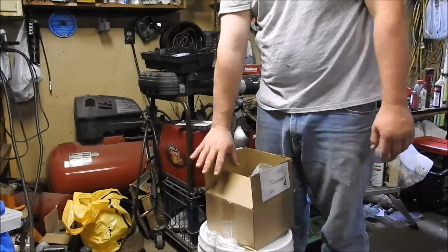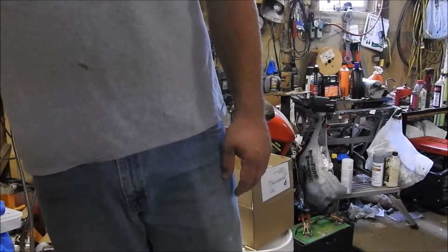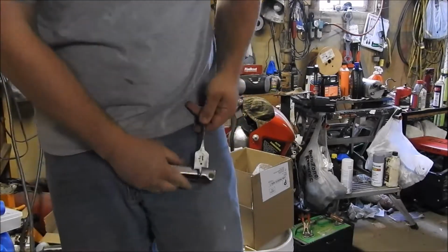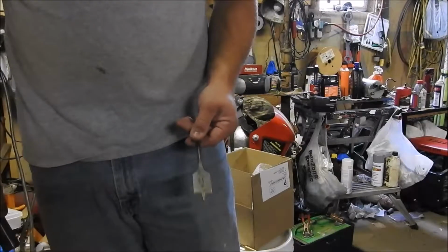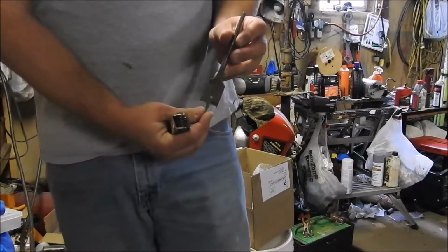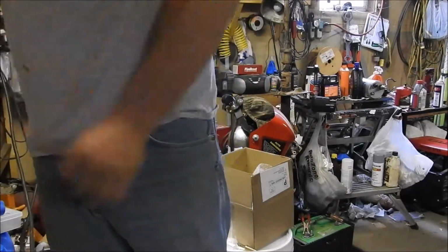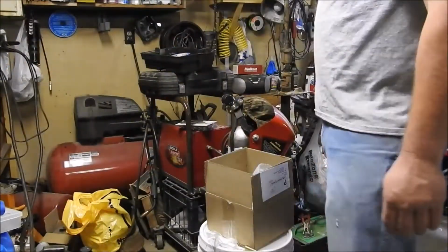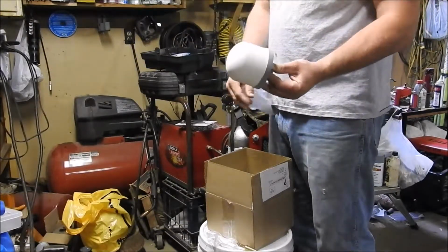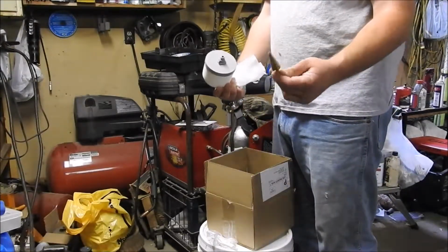So I've seen people try to drill these buckets using paddle bits, and for those who don't know, that is this right here. These things in plastic will actually make a triangle hole because there's nothing to guide the tip to keep it from going off center. So if you're trying to do precise holes like I'm going to be, then you want to use a round drill bit. And then I've got two of these ceramic filters. This is 1/2 inch, and again this comes in handy because it's got 1/2 inch on it.